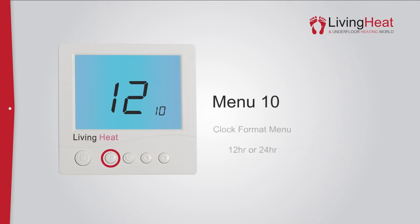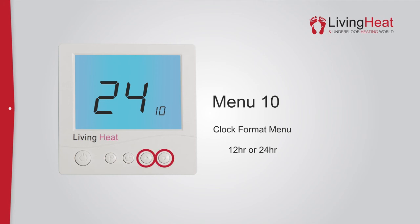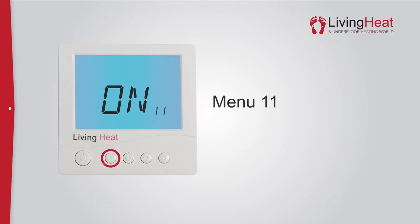Menu 10 is the clock format. This thermostat can be used in a 12-hour clock or 24-hour clock setting. Use the up and down arrows to set your desired setting, and then press the P button to move on to Menu 11. Menu 11 is Frost Protection Setting. When this is turned on, the thermostat will automatically turn on even if it is in the off position when the room temperature drops below 5 degrees, and it will then maintain a 5-degree room temperature. Use the up and down arrows to select your desired setting, and then press the P button to move on.